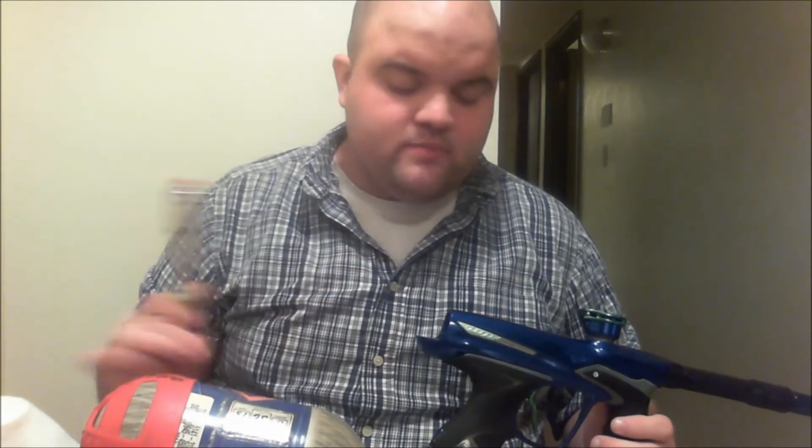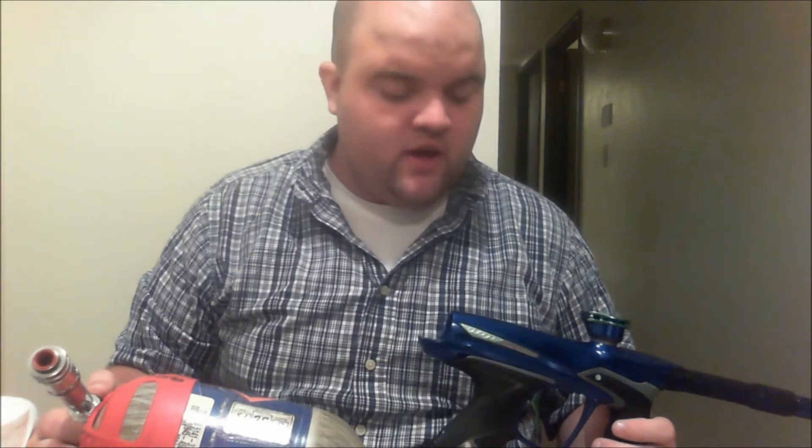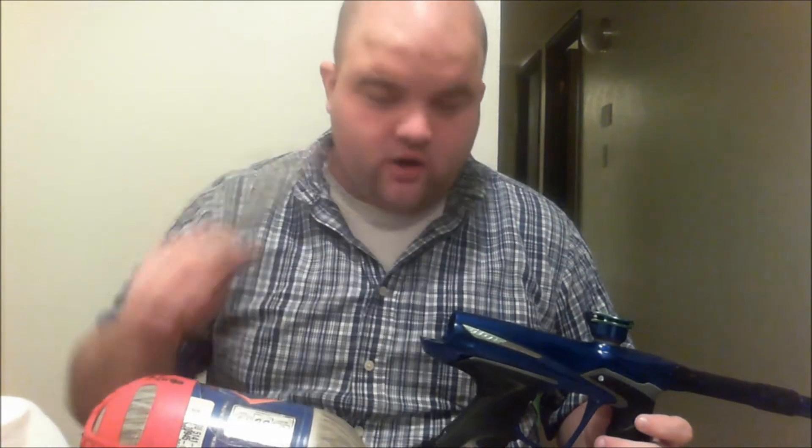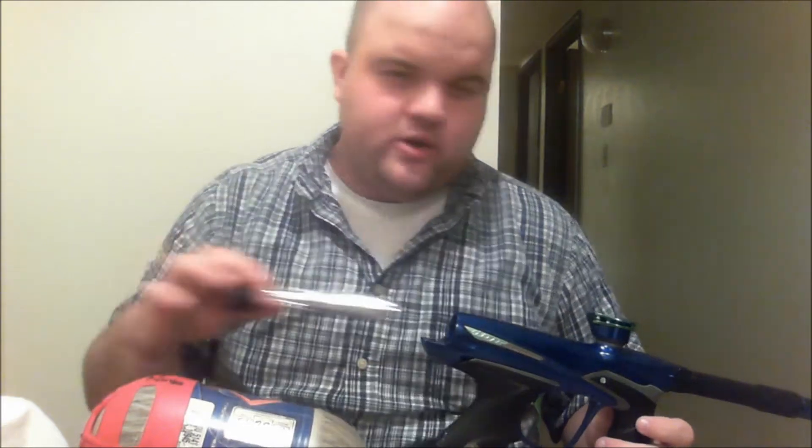Some of the factors I've noticed that contribute to this the most — it's not about how much lube you have on it, it's not about really anything to do with lube except for one thing. What it really comes down to is time. There's a lot you can read about stiction and how it applies to o-rings and sealing surfaces, but basically what you need to know is the longer this just sits here, the harder it is to pull out.